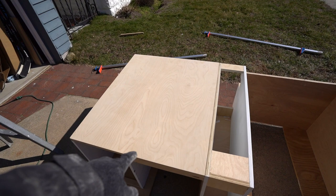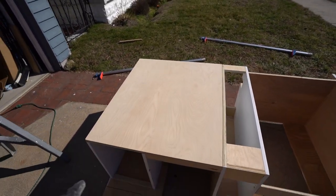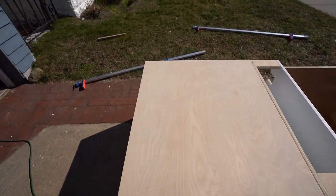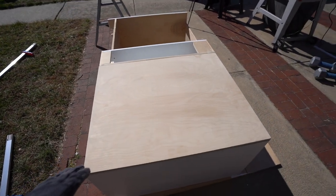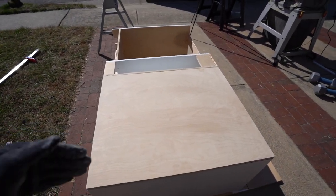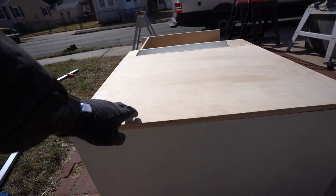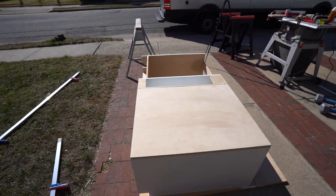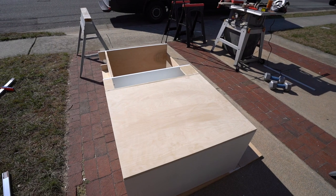This piece is what's going to be visible when we open the sliding door — it's going to be completely flush and smooth. We might put a little shelf on the back, but we didn't want any seams showing when the door is open, and it turned out pretty good. This is three-quarter inch — we maybe could have done half-inch — but I'd rather have strong wood back here if we decide to put the table in.